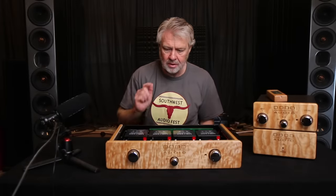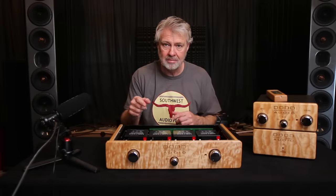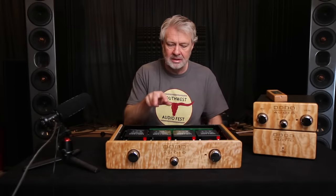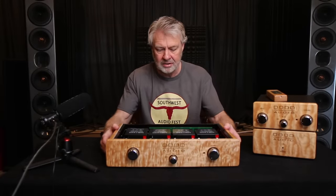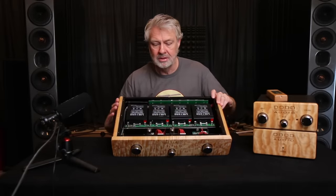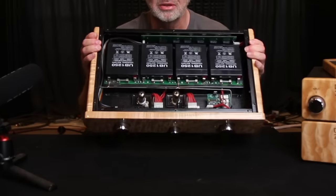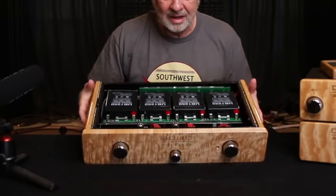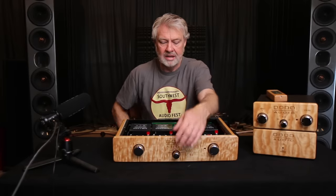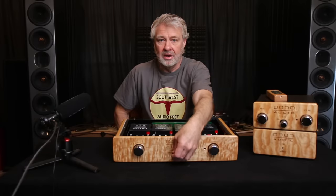He had done quite a few of these and the results were fantastic. I'm going to take the lid off and show you what he came up with and how this all got started being off the grid. He figured out a way to take a 24-volt supply and ramp up the voltage from 24-volt DC to 300-and-something volts AC to run these tubes. There's a pair of tubes and the circuitry is potted in a little pot right below the tubes so you can't see the secret sauce.